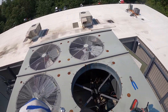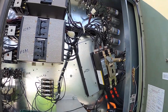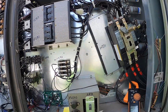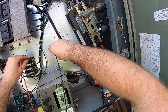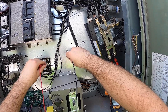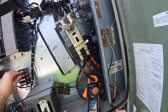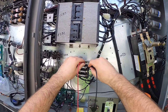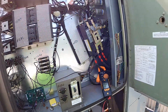Luckily we had these spare fuses here, so I popped two new ones in after disconnecting the bad fan motor. I did turn the system on and all three other fan motors operate properly. I checked my voltage here — right now the system's not off, this line is always hot, and then the second line comes through off the compressor contactor. So essentially what I'm reading on my meter is I'm just reading through the windings of the motor. If I go across, it's not going to read 460 — it's just going to read zero because it's the same line, same line at 277 there.